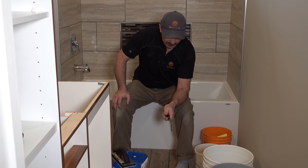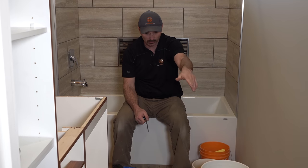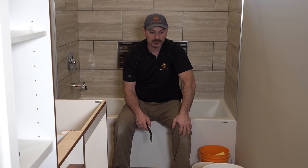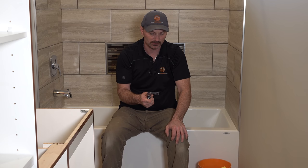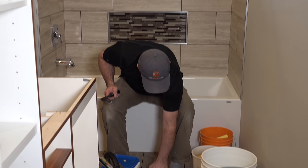When you're doing that process of cleaning the grout lines, in our case here we've got a heated floor — an electric wire below the tile. So when you're working in that kind of situation you want to be careful. You don't need to grind right down to the subfloor with this tool, especially if you've got electric wire, because you're going to risk damaging that wire — and it's going to get really expensive to pull up the floor and change that out. Just file it down so it's about an eighth of an inch or so below the surface of the tile, and that should give you all the depth you need for grouting.